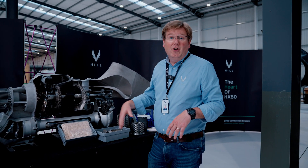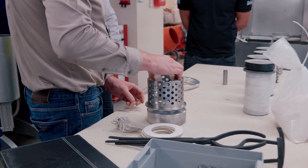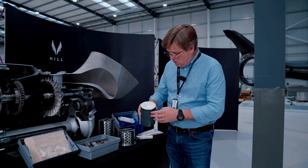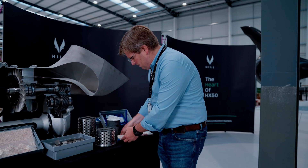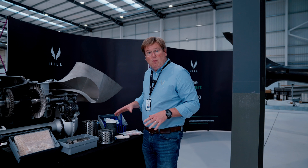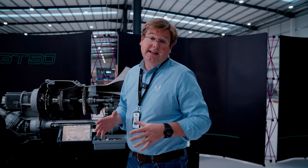Remember all of this goes on at upwards of 1500–1600 degrees Celsius, so it's extremely hot. We've also had to develop all of the flasks and tooling to adapt our molds and turbine running systems into the existing casting machine we're going over to Germany to test. We've developed a range of methods — a conventional conical feeder with a bowl at the top of the sprue, and a more traditional shell-based system with recipes compatible with the various waxes we're using. All of that work has been completed and we're now almost ready to go to Germany.